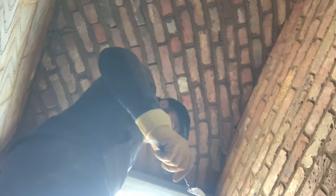What I'm gonna do now is pull the perps through, exactly the same fashion as I've done the bed joints. I'm gonna just give her a really good tug. I'm gonna just move the footing over so I'm not going up against it. There she goes. As you can see, you can see, almost like a weather struck. Slight angle on the small tool, giving her that compression.